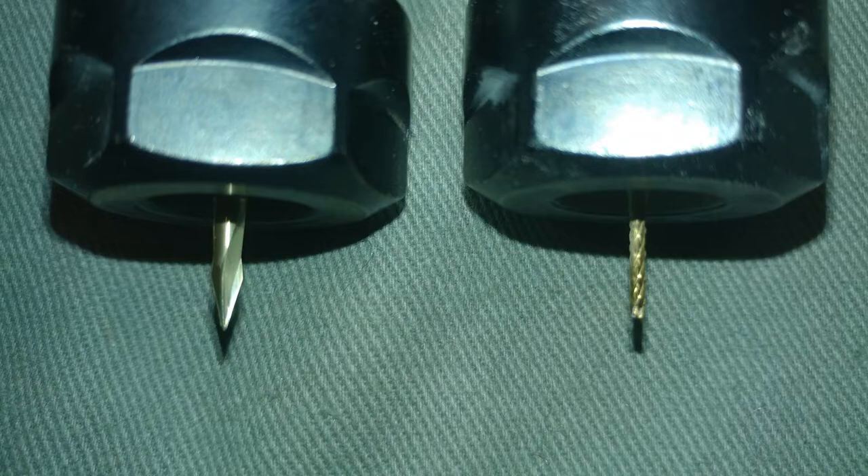Next, the cutting tools. On the left is a two-flute zirconium nitride coated 30-degree V-bit. On the right is a 1.5-millimeter titanium-coated tungsten carbide engraving bit. I'm pretty close up in this picture so that you can hopefully see the detail of the bits. I bought the V-bit on Precise Bits and the engraving bit on Amazon as part of a set. Links are below in the description if you're interested in purchasing them. You can also see here that they're mounted in their tool holder for the Tormach.